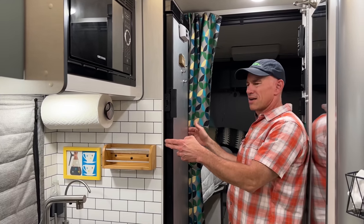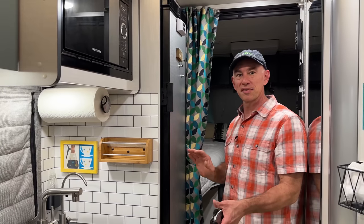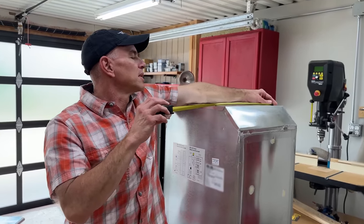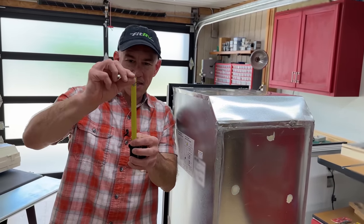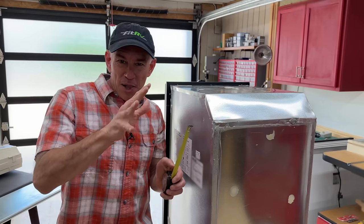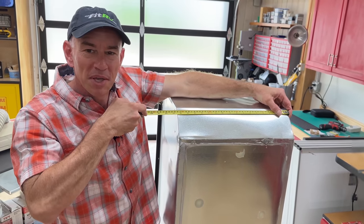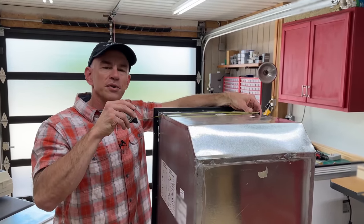This is 16 and just over a half inches, or if you looked at a Winnebago design document, it would probably say 420 millimeters. So this fridge, if you measure it, it's down to the jiggle. You know, on the end of a tape measure, how the end will jiggle this much. It's down to that tolerance of space if this will fit. So in some places I can measure this and it's 420 millimeters, right? But then in some spaces I measure it and it's 421.